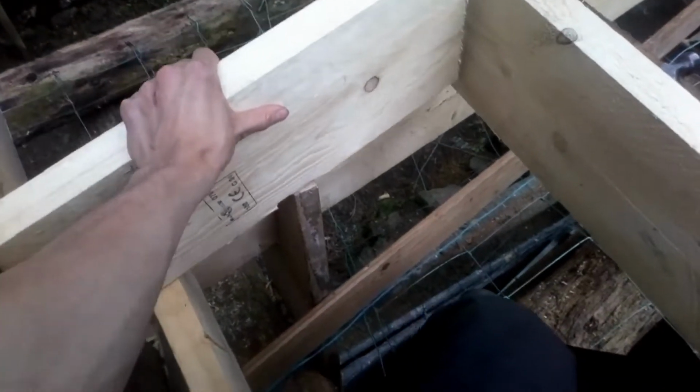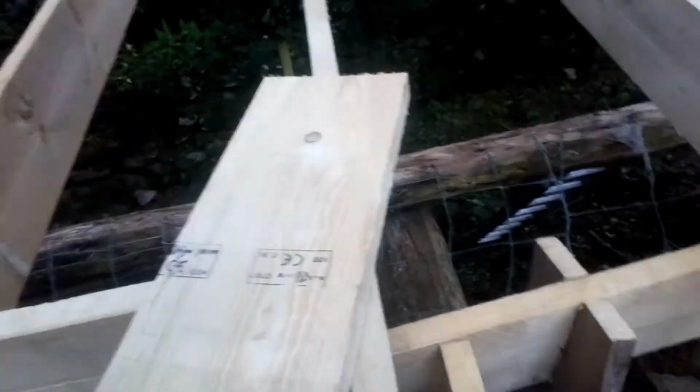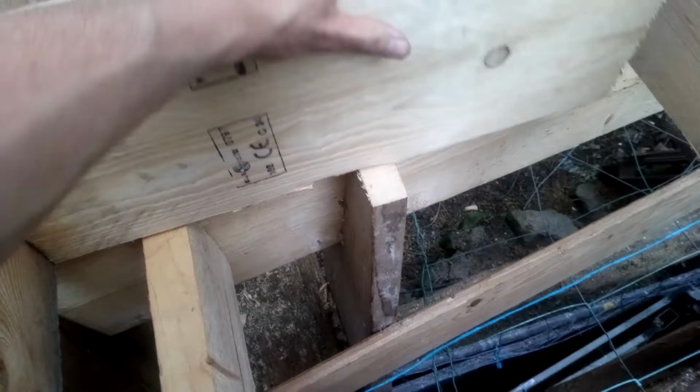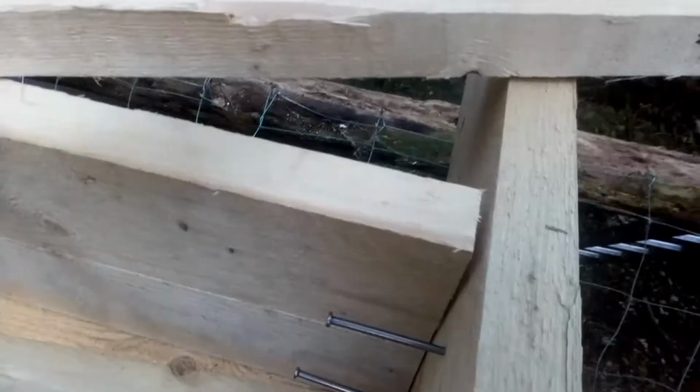We're so close to the end with the 7th joist when we come across another misfortune. This noggin won't fit because this damn thing is just slightly too high. Well, we brought our saw and well, we gotta cut this damn thing down a little bit. Comes off fairly easily just like so. And now the noggin should be able to fit properly. There we go. It does. Excellent. And so just the last few nails in here, we gotta preemptively put the nail in, check if it pokes out a little bit, hammer it in a bit more, and there we go.